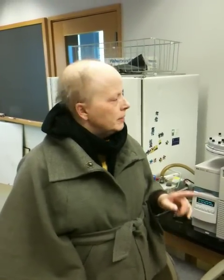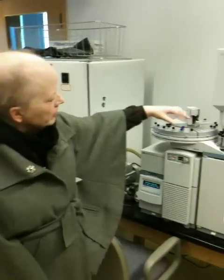The next video is going to cover how to make the sample. Making a sample is very important because this gas chromatograph is very sensitive to quantity, and if you overload it, you will damage it. Last year we had a little damage to this thing, so this year we're going to be super careful about the way we make up samples. If you think there's something wrong with that sample, you have to remake it — throw it out and remake it — because you cannot overload this machine. The whole class of samples will be put in and run robotically overnight, so you can't put a bad sample in the middle.